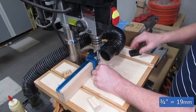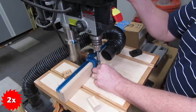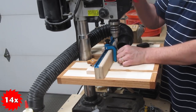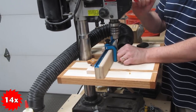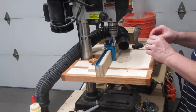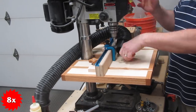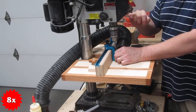I'm using a ¾-inch Forstner bit so the holes end up with reasonably flat bottoms for better glue adhesion. I made a center mark on one of the blanks and set up my fence and stop so the bit hits right on the mark, and I set my depth stop to what I think is the right depth. When you're doing a lot of pieces like this, it's important to check results every once in a while. In my case, the Forstner bit moved up in the drill's chuck and the holes got shallower, so I re-chucked the bit more carefully. When using the same bit repeatedly, make sure it doesn't overheat — take your time and back out often. All in all, it took about 20 minutes.